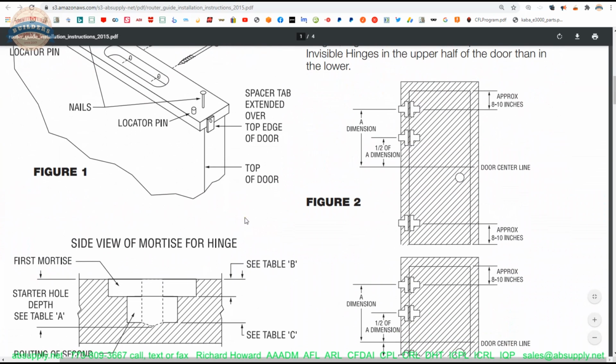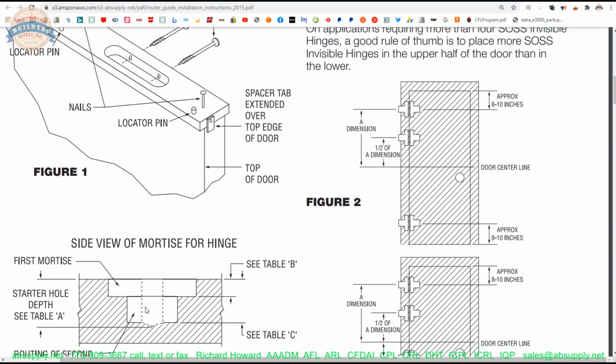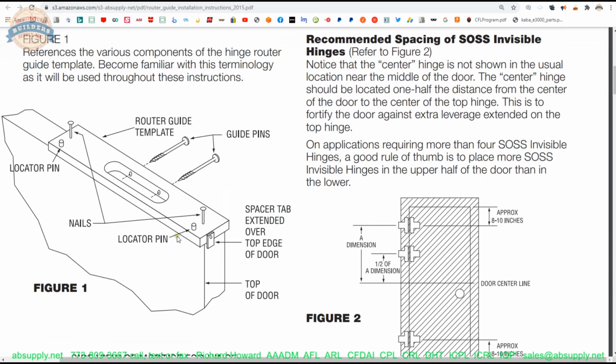And you're going to need a plunge router, obviously, and when you route this, you're not going to dare attempt to do all that at once. You're going to do it like a 1/4 inch at a time. Increase the depth of what your bit is prepping at, and continue to do that as you cycle down to get to the proper depth. And you can set the depth on your router as well, so that you know you're not exceeding that. Okay. So,